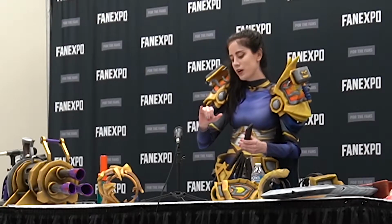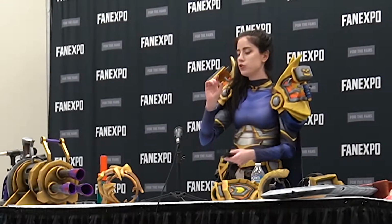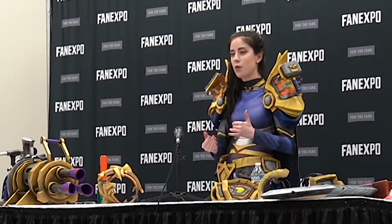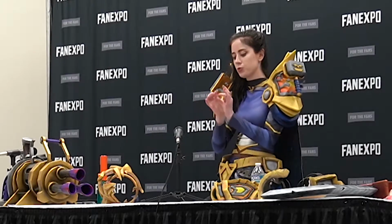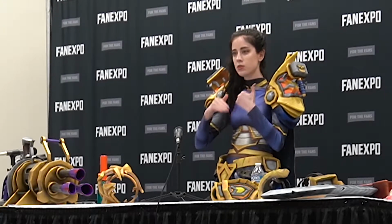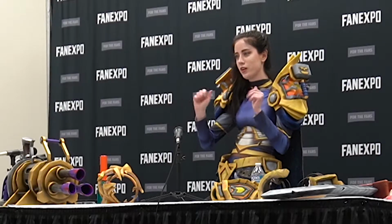And how you work with that is you apply it on the seam and only do about, let's say, 4 inches at a time, because at that point it's going to dry faster than you can work with it. Then with a paper towel and a little bit of water, I normally rip squares about that big and just wipe off. Anything on the foam that's not in the seam should start coming off, and then you just leave it in the seam, and it will dry that way and you're good.